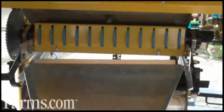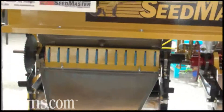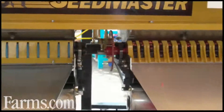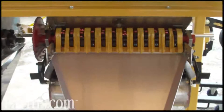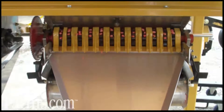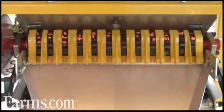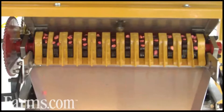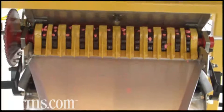On the same display we're showing you a prototype of what we're doing for corn or for larger seeded crops. This also has our zone command on it. This is corn being metered at about 30,000 plants per acre, and again it falls into the individual tubes and gets a direct route to the opener.